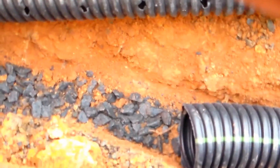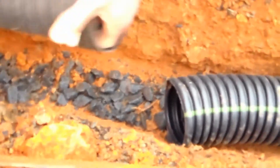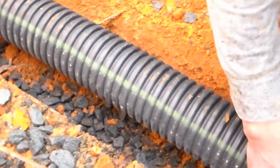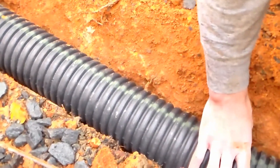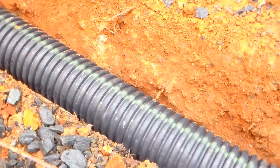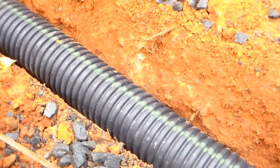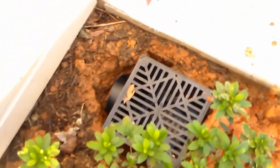We've got our perforated pipe — you can see the holes — and we point those holes down into the trench. The reason the holes point down is that water floods from the bottom of the trench up into those holes. We put gravel on top, and all the water drops through the gravel and comes up at the bottom. Notice the green line on top of the pipe — that marks the top, so you'll know it's oriented correctly when you hook it up. Next, we'll put a tee on it. We've got a line running back to the catch basin installed here, which picks up any excess surface water.